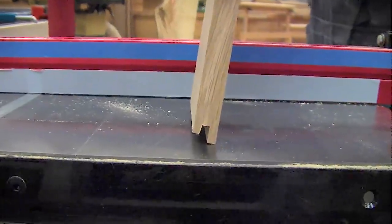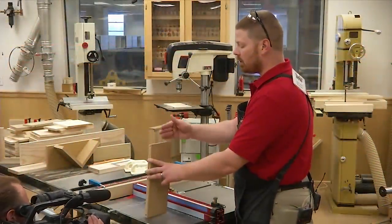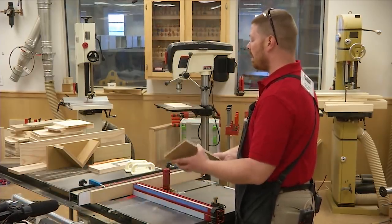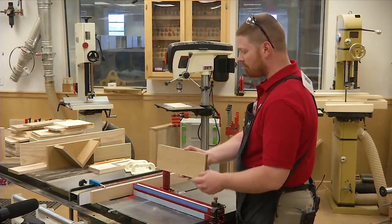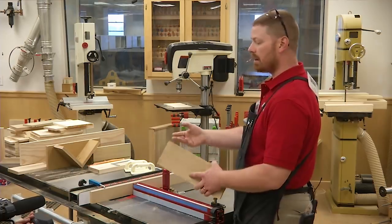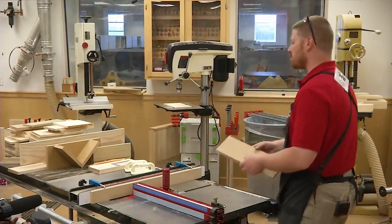The only different thing about this, on the first drawer we did, we could start with all the sides, machine all the sides, and then get that rabbet to fit in there. On this one, you have to just about do the front first, and then do the sides. One negative thing I find about this style drawer is that the back of it, I really don't want to go through all this work to make the back of it look like this. I'd want to do the back like I did before, where it's just a rabbet. So I have yet another setup.